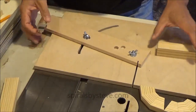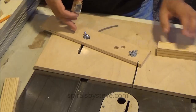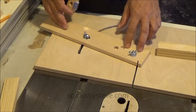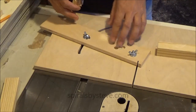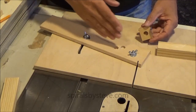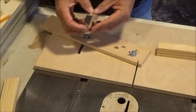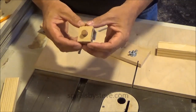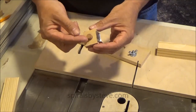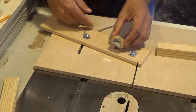So here's the setup. This is my jig that I made — the table saw sled. It's got this fence, and it's got these two bolts with wing nuts holding it in place. I can just loosen one up and it slides in an arc. Everything — this fence and the mirror that's on it — will all rotate together through the same angle. Here's the mirror: it's just a piece of glass mirror glued onto a small piece of plywood with a hole drilled through it. I used a plug cutter and made a plug that fits — it's just a friction fit in this hole.